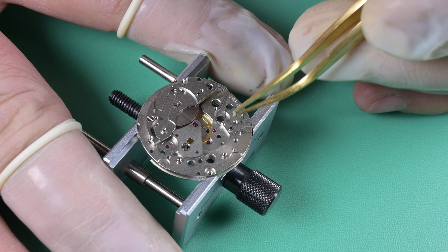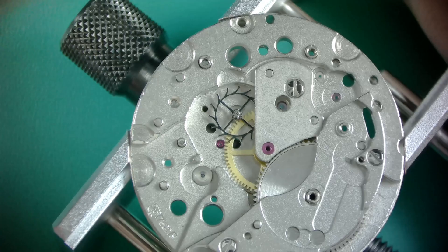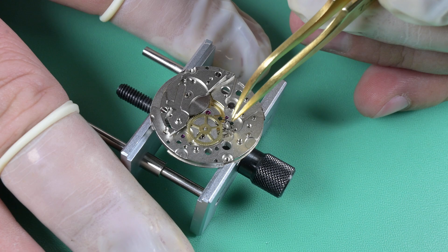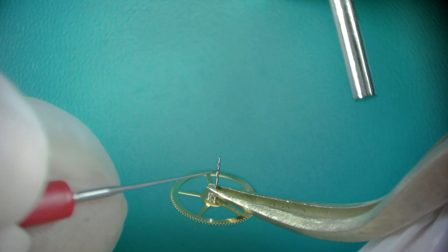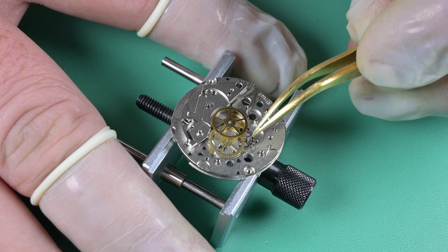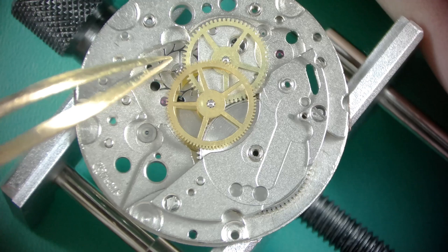Installing the bridge is always either really easy or sometimes super stubborn. I do the tap trick on this one — it's not just a Seiko thing, I do it on every watch. Everything went in except the top pivot of the escape wheel. I'm putting very, very light pressure down on that bridge and adjusting the escape wheel, then off-camera turning that barrel, and you can see the pivot kind of sets in place. I keep very light pressure — just enough to keep it from moving without forcing it down — and get both screws started before releasing pressure, because those pivots are not very long and don't take much to move out of the way.